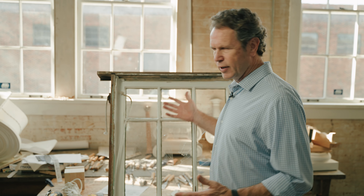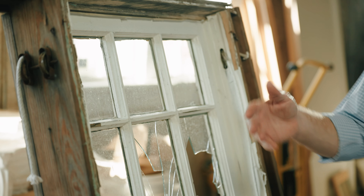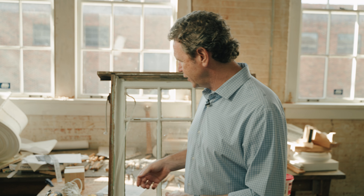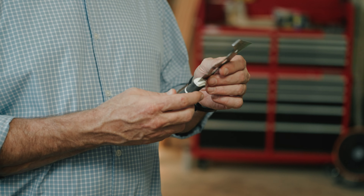The first hack I'm going to show you is getting the windows operable again. This window I got from a salvage yard — they have windows like this that have been taken out of houses. You've really got three things that are wrong, or the reasons windows aren't working: either the cords have been cut, the weights in the wall are stuck, the glass is broken, or the window won't open because it's been painted and caulked shut. The tools you need are actually pretty simple and easy.